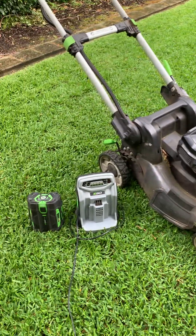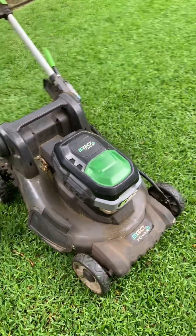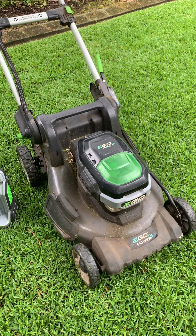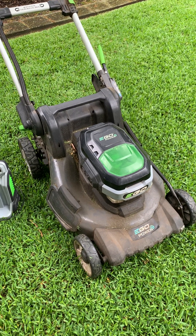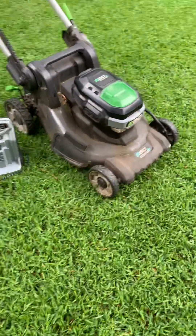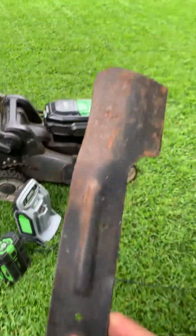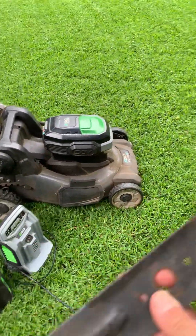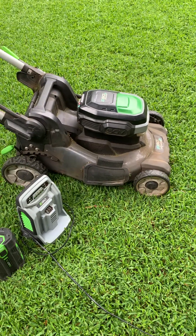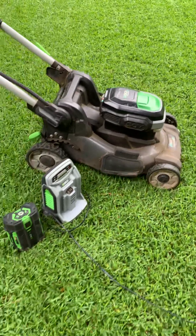That's one of the big reasons why you would choose Ego over the others. The reason why this mower is so good is its RPM — it spins at over 3,000 RPM unloaded, which is very important for cutting grass. If you have a look at the blades, in reality you only have a single blade with two cutting surfaces which are quite small. You need that RPM so you don't leave stragglers and you get a nice clean cut.